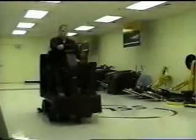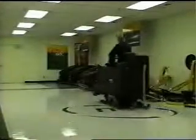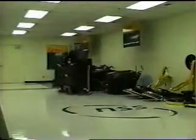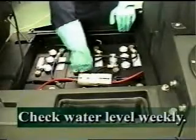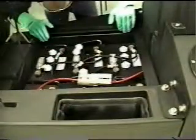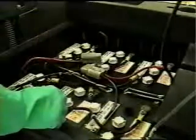The Champ ZS-29 is equipped with six batteries which, when fully charged, will provide hours of continuous run time. The batteries are a maintenance-intensive area — without daily battery servicing, your scrubber will not run. Be sure to check the water level in the batteries at least once a week, and once a day isn't bad, especially when the weather is hot. Check the water level only when the batteries are fully charged, as the level may vary based on charge. Fully charged, the water should be about half an inch over the battery plates. Never recharge the batteries if the water level is so low that the plates are exposed, so fill the batteries to the proper level before you charge.